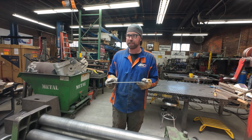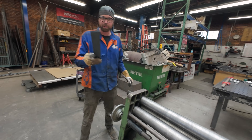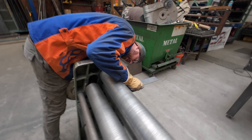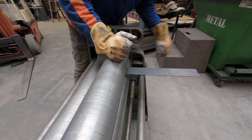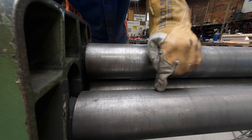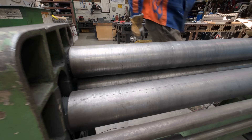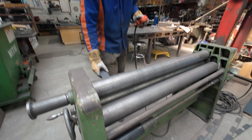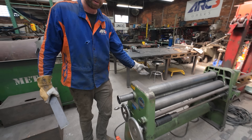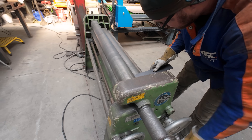We're right back. So here's what you do — and by the way, we'll link to the YouTube videos I watched. What you do is you set your pinch. These pinch rollers work by physically pinching the material. This is the bend roller, and these are the pinch rollers. Once you have it set, take your material out. This is the side you normally feed it through, but you actually want to feed it through the other side. You set your bend roller up a little bit.